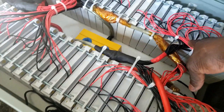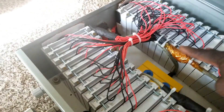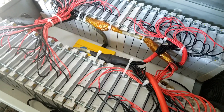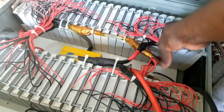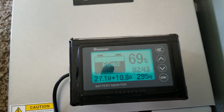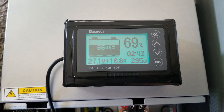So 24 volts — I tied two batteries in 12 volts for 24 volts. I have two positives, so I parallel here and connecting series. If they charge the 12 volts at 15, then times 2, so it's going to be 30 volts.